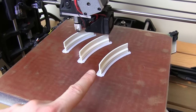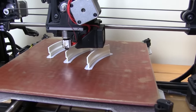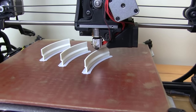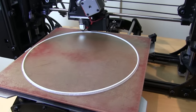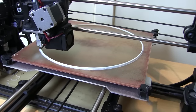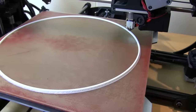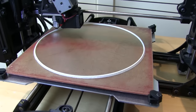My first approach is to print the thirds in thirds themselves — so those are printed in three separate pieces. And of course the warpage will be less because there's less tension across the layers because they are smaller. So I could print nine pieces and stick those together. And of course there'll be lots of seam lines where the nine pieces are stuck together, but that may not look out of place on that skirt piece anyway. The second approach of course is to print it all in one piece. Unfortunately it doesn't quite fit on the bed of the TAS, so I've had to make it 2% smaller. So we'll see how that turns out and whether the whole thing sticks. Unfortunately there's not space for a brim, or at least there's a very small brim before I run out of the printable area. So we're gonna see if that builds up and if that works out.